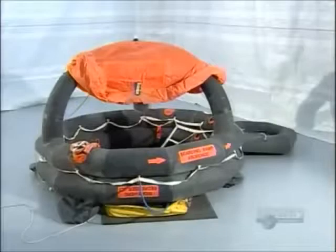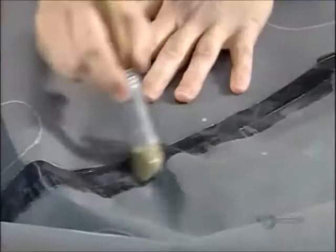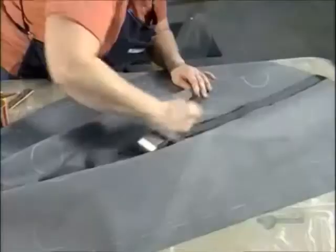Pull a cord on this pack, and you have an instant lifeboat, complete with a roof. To make one, the computerized blade cuts shapes out of rubberized fabric, while a plastic film helps hold it in place. They brush on a rubber adhesive to seal the boat's joints and press rubber tape over the glue, then remove air bubbles. It'll take several days for the bonding to be complete.